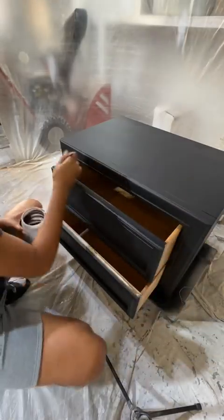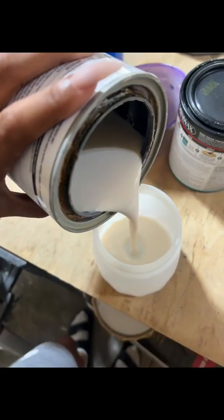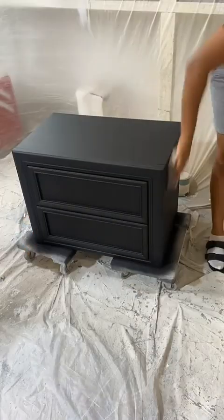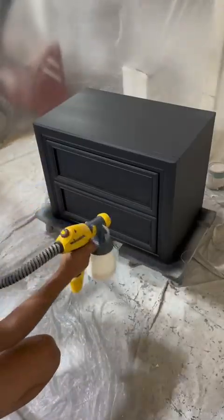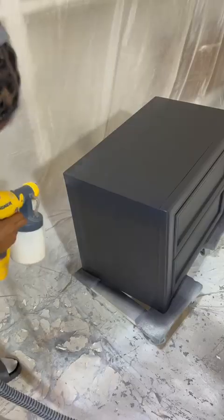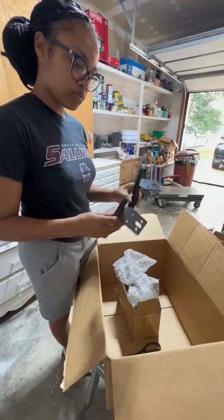Once dried, I used a small painter's brush to touch up the top and side edges of the drawer where the paint gun couldn't reach. For top coat I used water-based polyurethane — this was the perfect demonstration of why you need to use a paint strainer so you don't clog your gun. Another super light scuff sanding, then I adjusted my gun air power all the way down to two. I apply several coats in a fine mist. When dealing with black or dark colors I'm careful because I don't want that cloudy, hazy look the top coat can often give.